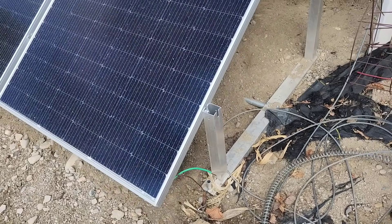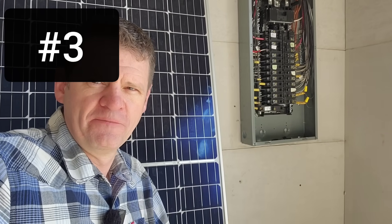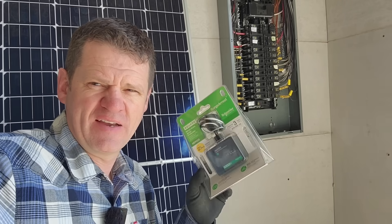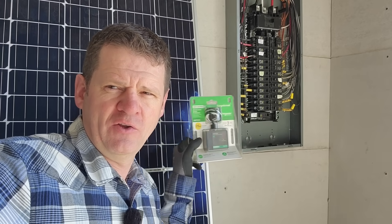These ground rods really have nothing to do with tripping the breaker. They're designed to stabilize the voltage and collect and disperse excess energy rather than your electronic equipment having to do that. The next thing I'm going to check, somewhat related to power fluctuations, is whether I have whole home surge protection. As of the last couple years in the United States, we are now required to have a device like this attached to our electrical panel, either inside or on the outside. Most of these are designed to sacrifice themselves against one surge, and then your house continues to function as normal and you need to replace them.